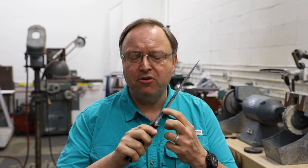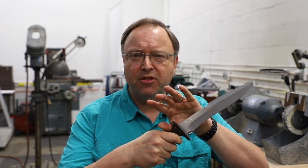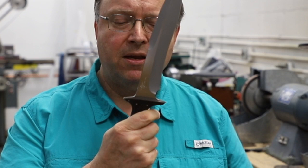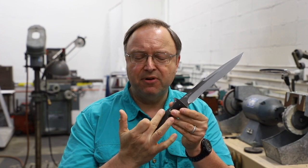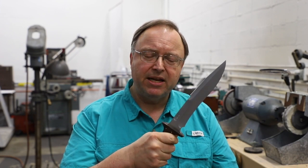On the back of the knife there is a groove called a capture cavity groove. It is designed for close quarter reinforced cuts where the thumb would hook the top of the guard in the third position grip, apply a reinforced cut, and also provide more resistance in a defensive mode up close to the torso. The guard curves backwards up top. There are hand file serrations — 20 teeth per inch — that I hand file into the blade, as well as 20 teeth per inch serrations that I file into the grip of the knife. These are for added control under wet, slippery conditions.